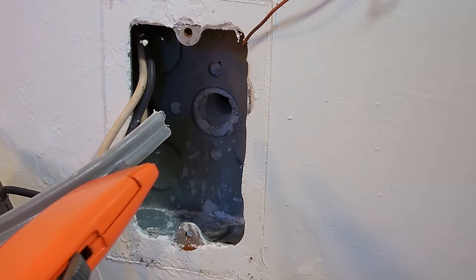Okay, you can see one set of wires, which is going into the conduit at the top over here, to the next receptacle, was removed from the receptacle on the bottom screw on both sides. Take this white wire now, make it straight. We're going to twist the two together along with the pigtail wire. Let me do that and show you what it looks like before I connect it. Here you can see the wires are all nice and straight.